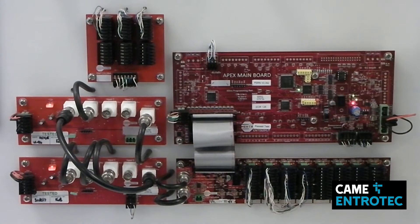We're now going to be talking about connecting up an Apex system. This is your door bus here, so what I expect to see going out to your door panel is a 0.75 minimum three-core flex, and that's up to 50 meters. Any more than 50 meters, use the next size up — a 1mm or 1.5mm.